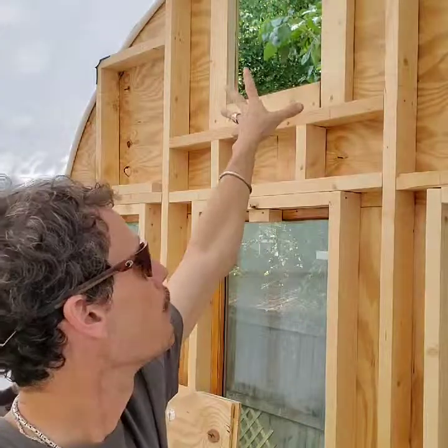Alrighty, good afternoon. Finally getting back on this project, and as you can see, made a lot of progress. We've got the frame put in for the exhaust fan, and it's 16 by 16 for the opening. It has a little flange that goes around the outside that we're actually going to lag bolt in. So we're going to use lag bolts.